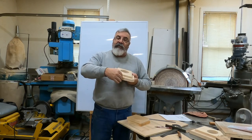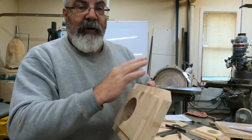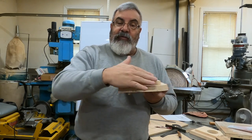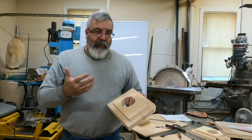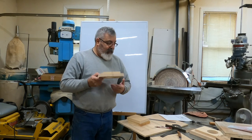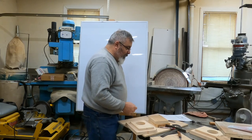The edges of the core print here, all these edges, I'm going to keep them square, minus the 10 degrees of draft on it, but I'm not going to round these corners at all. On this pattern, I'm going to round the corners a little bit. It helps with the casting. The core box, the reason I'm not going to round these is because,